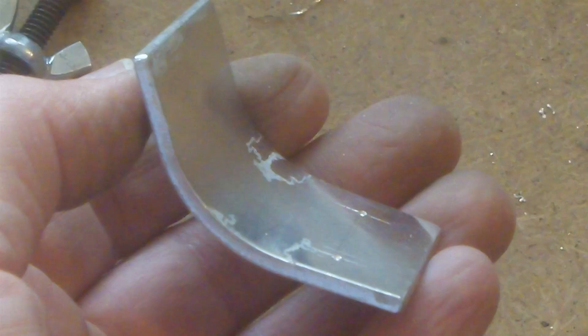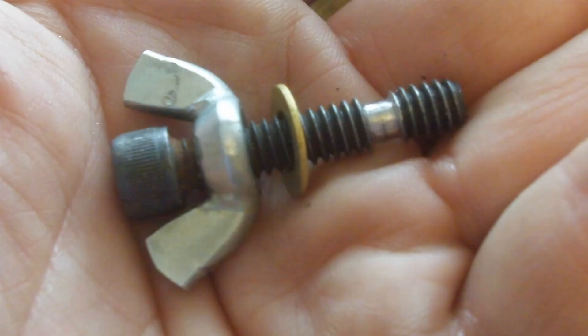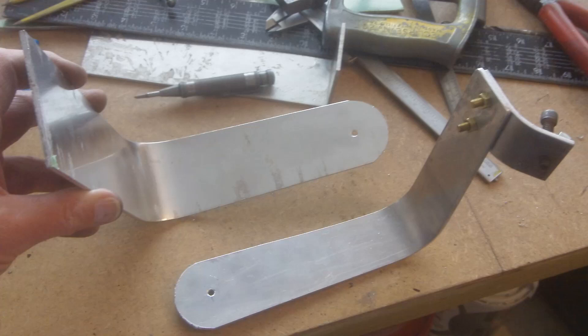If you make one for yourself you'll soon understand what I mean by that. This is the bolt that goes through the camera bracket, and I've modified a 1¼-inch bolt by filing away some of the threads. That allows the bolt to remain captive in the bracket when I take the camera off. The little wing nut is used to lock the camera down in position. Here you can see on the right I've got the camera bracket fixed, and I can swing that round to make the bracket left or right handed, with those two brass bolts.